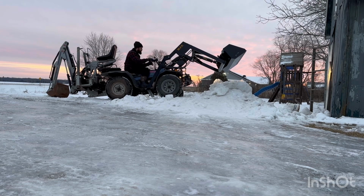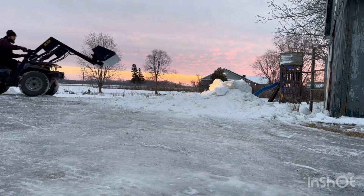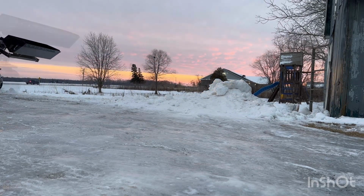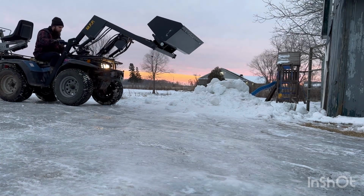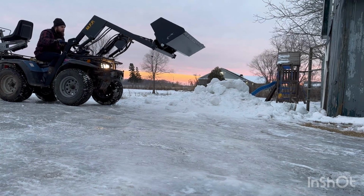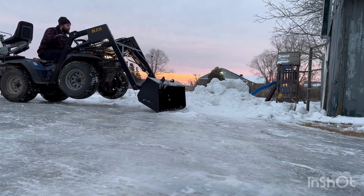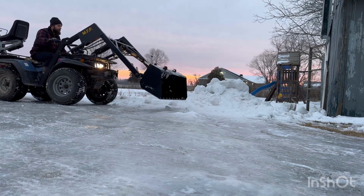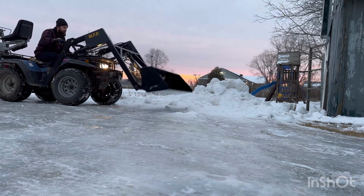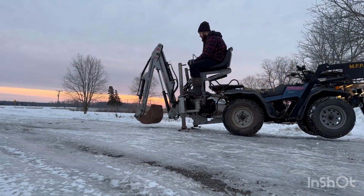The pump does well, over 3,000 psi, only a 2 gallon a minute pump, but that's plenty for what is needed here. You lift about 4 foot 6 inches to the pins. I got a couple of pins and hooks on the front, so you can use a chain, and this unit has a trailer mover, as well as a grapple for moving brush.